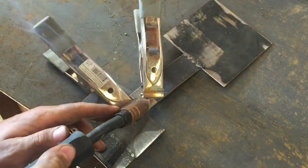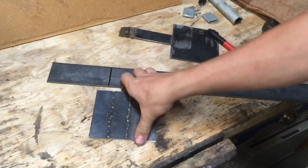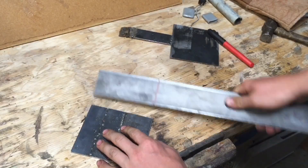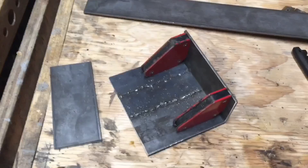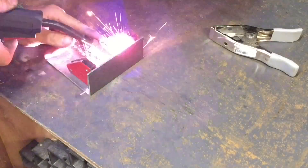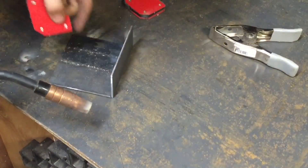While mounting the hinge for the wrist movement, I decided it would be smart to leave the top plate unconnected for now so that I could build the arm-covering part of the gauntlet and attach the magnet to it — it would be much easier to work with it detached. Then I measured out the lengths of the sides so they could cover the sides of my hand, cut those on the chop saw, and tacked and welded them on with my MIG welder.